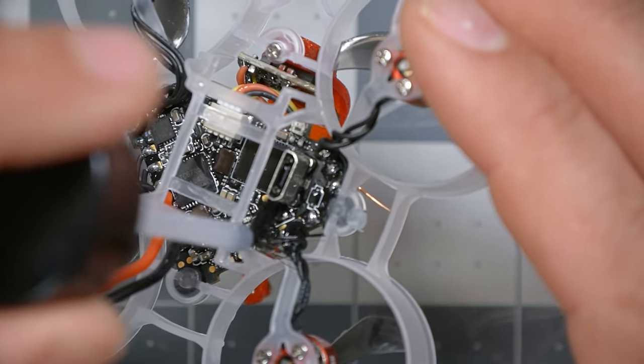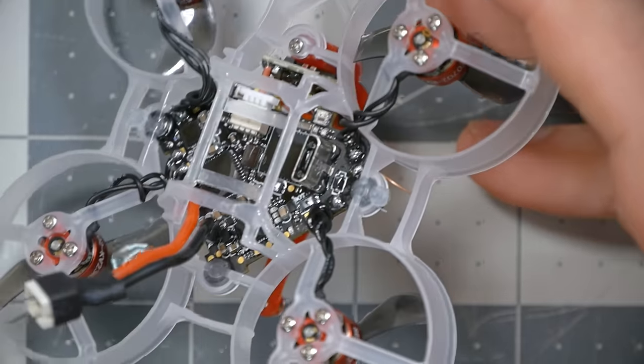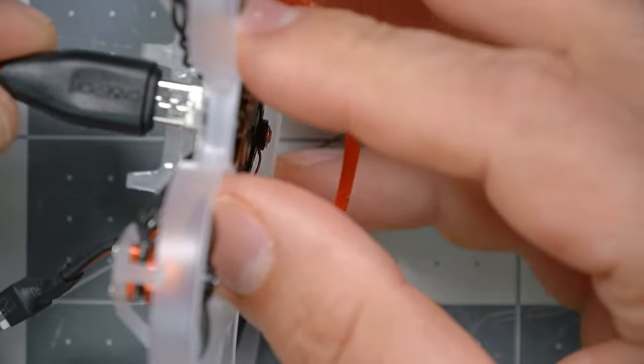You might think of course you would want to waterproof the USB port — it has five volts, electricity's in there, so you don't want water and electricity to get together. But the problem is that conformal coating protects by literally forming a layer to block electricity from getting to the other side of the layer. And unfortunately, that's how USB ports work — electricity has to get to the other side of the port. So if you get conformal coating on any kind of plug — your camera plug, an ESC plug, a USB plug — it won't work. I've given the conformal coating a little time to dry, plugged in USB, and the flight controller does not power up. Doesn't work.